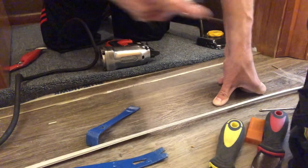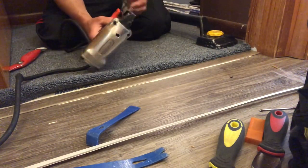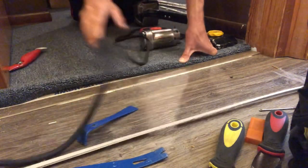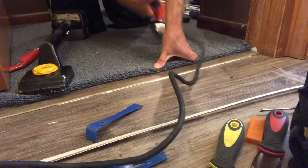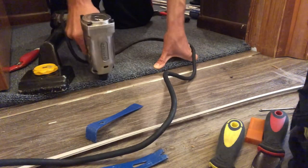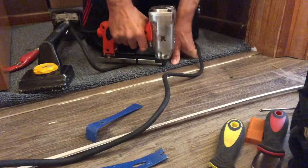I'm searching around for staples now — here's one thing everybody has on me: I'm about the most disorganized dude when it comes to keeping staples in line, they're flying all over. Reload that staple gun and continue stretching. Now I'm going to stretch up the other side, making sure the carpet is butting up nicely to that reducer, and throw a couple staples in there to make sure everything is secure.